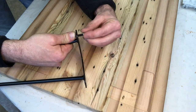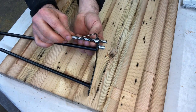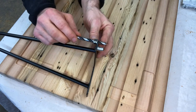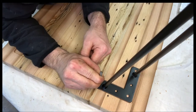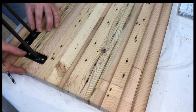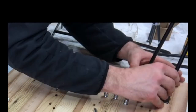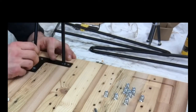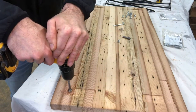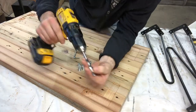Actually using this hardware — this is what I do just to make sure that my depth is correct. I'm setting that on the drill bit to make sure we're the same every single time. You can use tape; a lot of guys use tape. We have these stops, we use them, I love them — I just don't want to blast through the other side of the table. Before we drill the holes, we're going to have to mark them. I'm using that brad point bit — it just gets dead center in the hole. You want to really take your time and make sure your holes are perfect. Get it as exact as possible; maybe pull out your square.